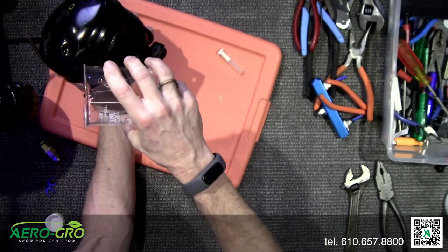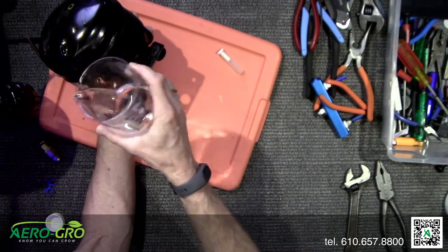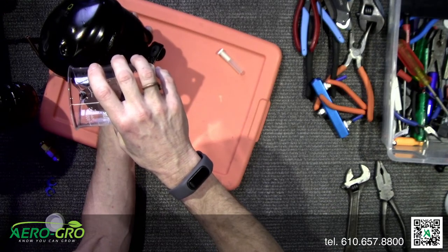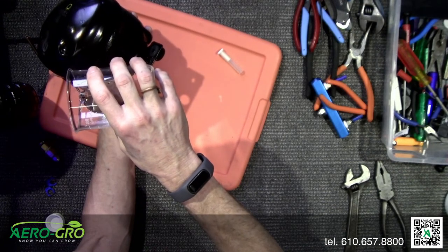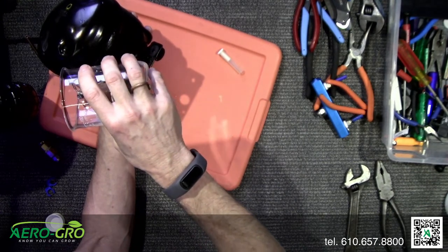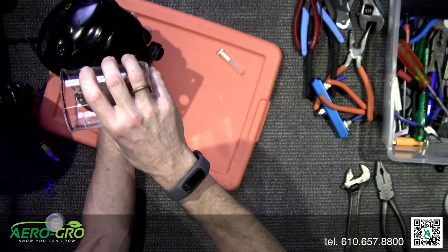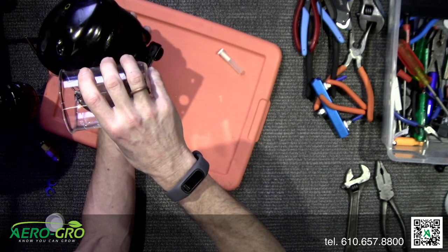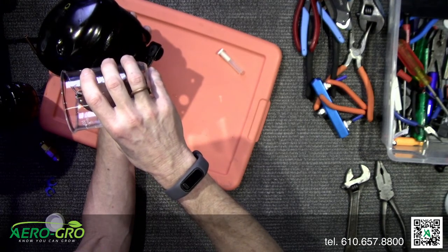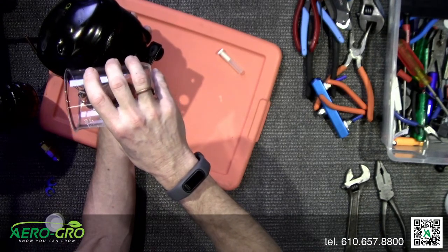Here's the other thing about tubing I can tell you, is that if you go, for example, from a 1/4-inch piece of tubing to a 3/8-inch piece of tubing, it doesn't seem like a lot. If you look at them side by side, you notice there's a difference in size, but not a tremendous amount of difference. Yet the amount of liquid or air that you can pump through that slightly larger size tube is very significant, because you have to remember you're looking at a cross section of it, but if you look at the entire piece of tubing, you're talking about a pretty significant increase in volume, even if it's just a slight increase in tube diameter. It's a large increase in the tubing's capacity to carry material.